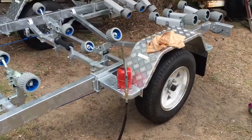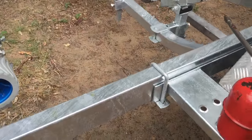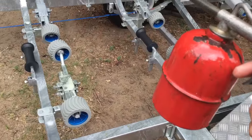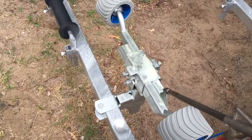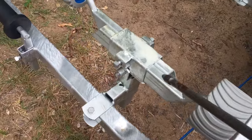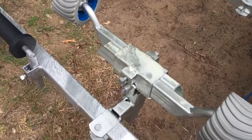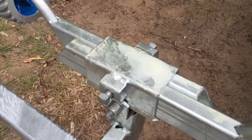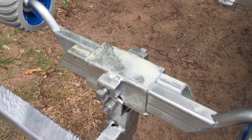Then while it's still hot, you stick it in your container and spray it. It puts a very thin film of boiled linseed oil across your trailer, which acts as a protective coating all over it.